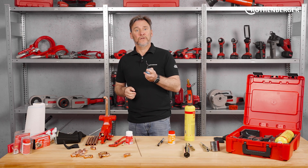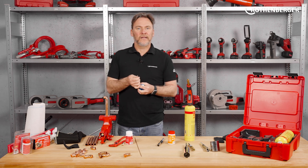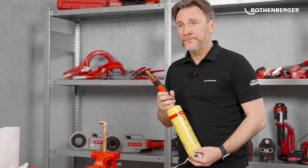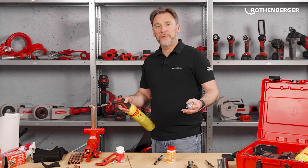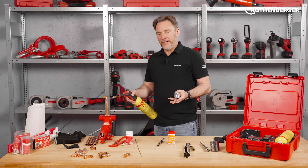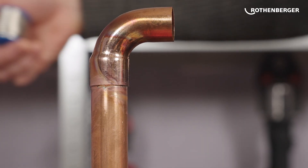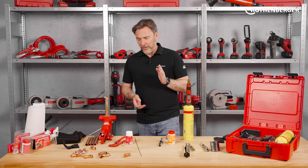Then you'll need the right solder for your flux — it's important the solder matches the flux. We have Rosol 3 and the fitting Solder 3. How much solder do you need? You use the diameter of the pipe — generally about that length. When soft soldering it's important to aim the tip of the flame at the end of the solder joint where the solder should flow. How do you know when the pipe is warm enough? Watch the flux — it will suddenly turn a silvery shiny colour, and that is when it's the right time. Now the soldering connection is finished. I only used the pre-measured amount of solder and you saw how the solder was drawn into the pipe. The pipe is now extremely hot so I'm going to grab a pair of pliers and cool it down.